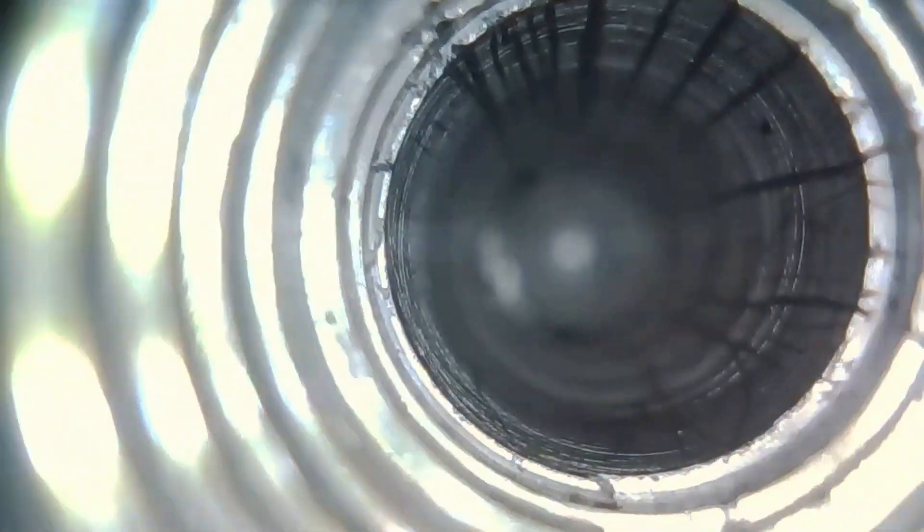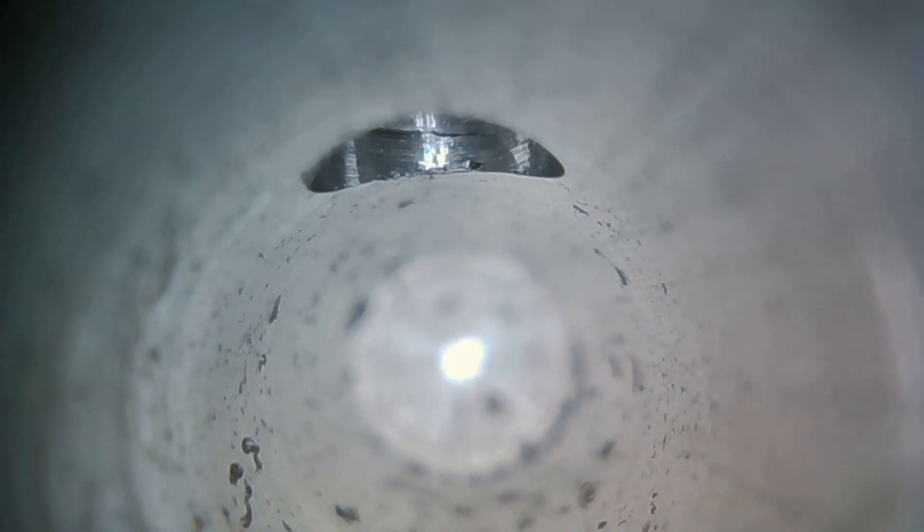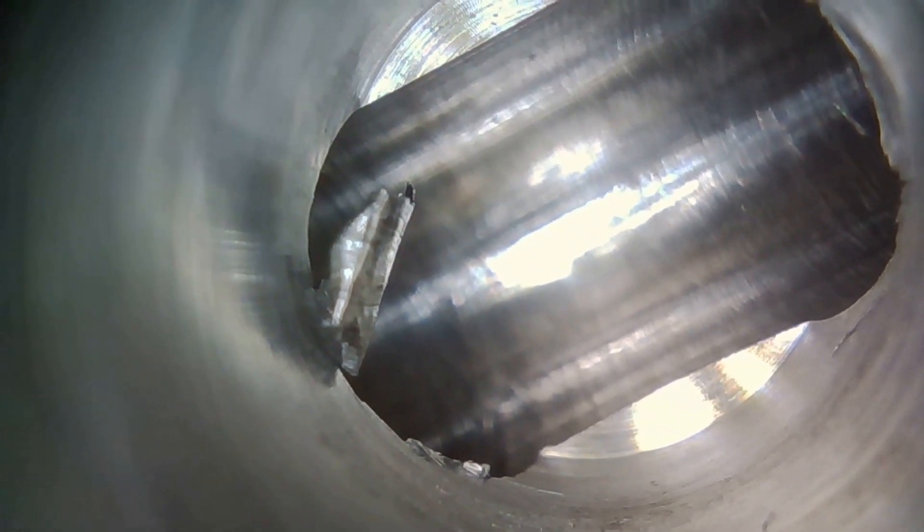The first thing we're looking at is an engineering component. You can really use this as a great inspection tool to dig in deep, whether you're looking at parts that have been machined or custom made, or even parts for your car or vehicle, or locations where you may not be able to see with the naked eye. This is an incredibly versatile tool allowing you to inspect a wide variety of parts and components. A lot of times when you're cutting channels you want to check for burrs, contamination, and different things like that. As you can see right here, it's detecting a burr — if this were a flow channel and that burr dislodged, it could potentially get stuck in tubing hookups and cause issues in the future.